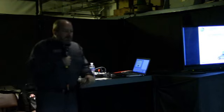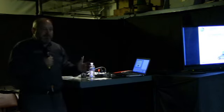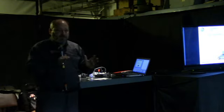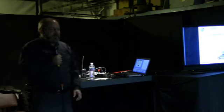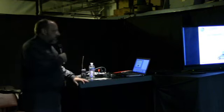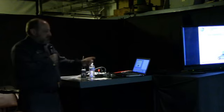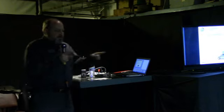So on the land mobile side, on the commercial side, everybody's been going to narrowband, right? So instead of 25 kHz channels, which has been the standard on the commercial side, they went to 12.5 kHz channels. Well, this is actually ultra narrowband. It's 6.25 kilohertz occupied bandwidth. The newer radios are a little more spectrally efficient than the original ones, but it takes a little bit